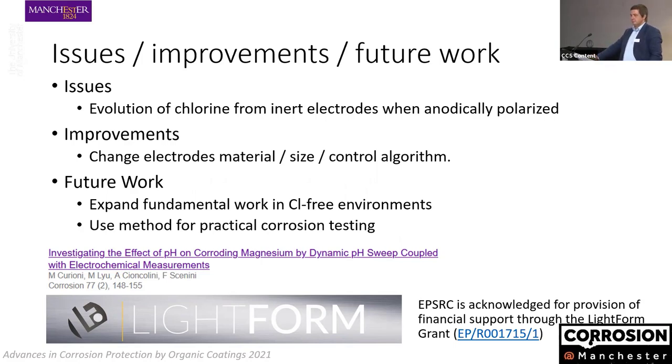That's a good idea. There's also a relevant piece of evidence from long ago — Mervyn Turner, who ran the corrosion group at ICI, told the story of a plant making ammonium nitrate by reacting ammonia and nitric acid. Sometimes it caused very rapid corrosion of stainless steel, other times it didn't. They eventually concluded that allowing the ammonia and nitric acid to be pumped in at different times cycled the pH, which rapidly removes corrosion product — because the corrosion product in ammonia is one thing (iron oxides) and in nitric acid it's chromium oxides, or maybe the other way around. That's a more extreme case, but an interesting one.